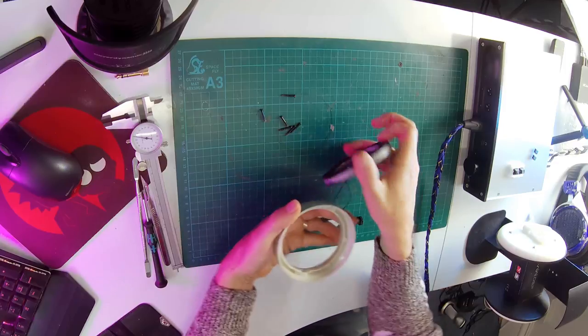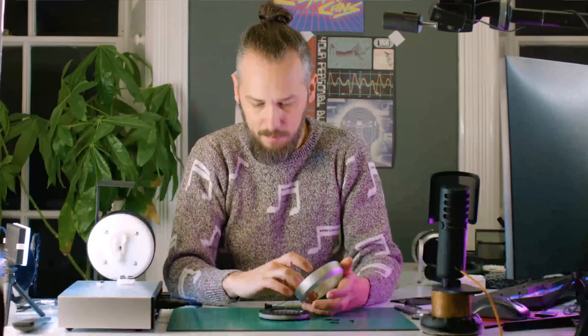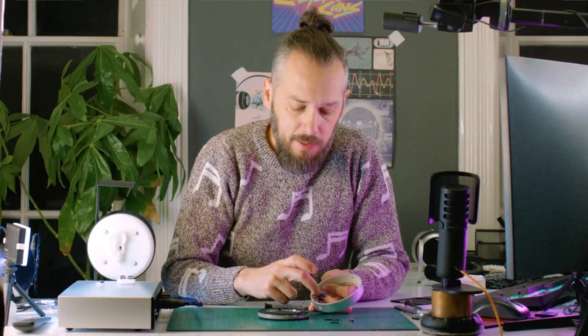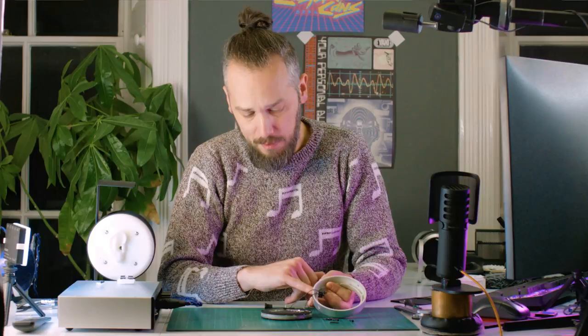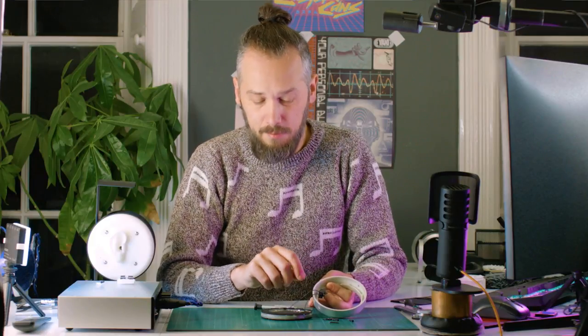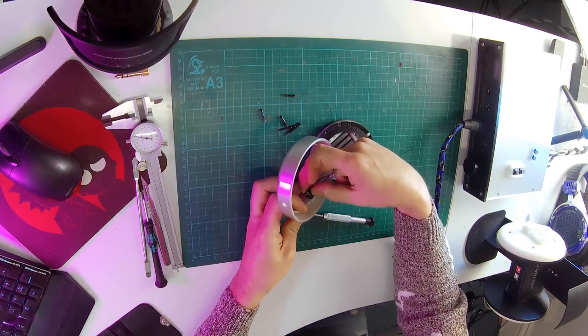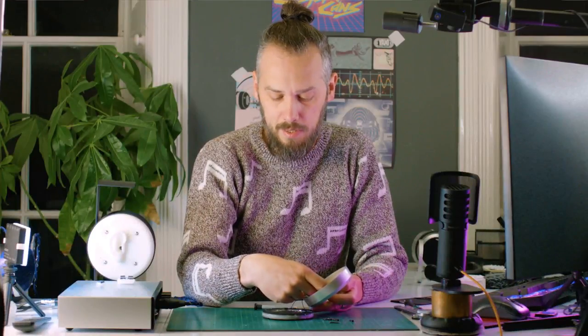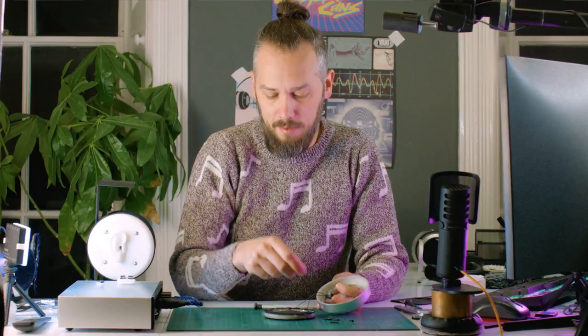What will happen then is you will have the socket dangling on a wire from the socket on the bottom there. Now, this socket is going to be glued in place. It's going to be glued either side, and it'll probably have glue around the little retaining nut there. What you want to try and do is scrape that out with a scalpel or something like that. Just remove as much of the glue as possible, and then get your pliers around the socket, give it a bit of a wiggle, and you should break the glue, and then you can work it out. You can either unscrew it from this side or unscrew it from that side.